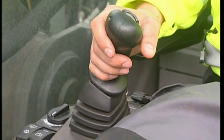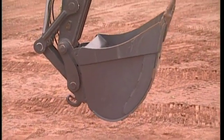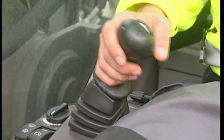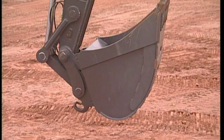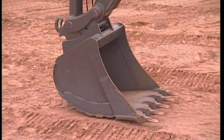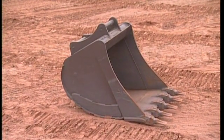Curl the bucket in until you reach the end position. In the end position, continue to curl the bucket in order to acquire maximum pressure in the locking cylinder. Now try opening the bucket once again and you will see that the attachment is free to place on the ground. If you are still unable to open the QuickFit after this end position operation, then something is wrong and you should contact your dealer for the necessary support.